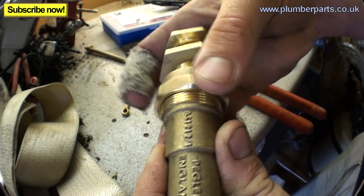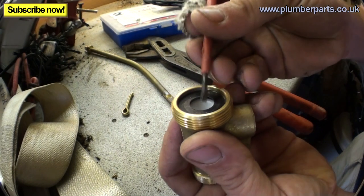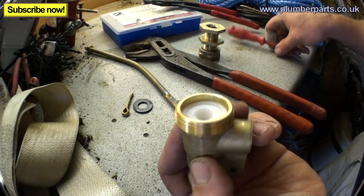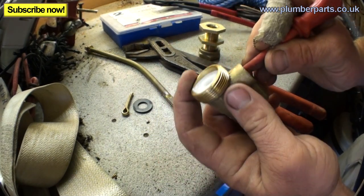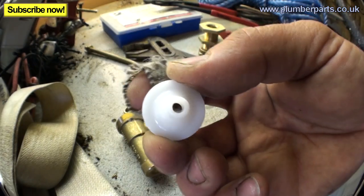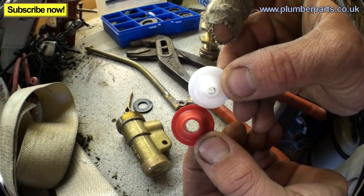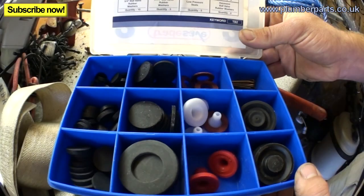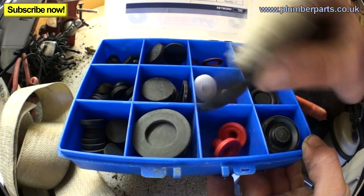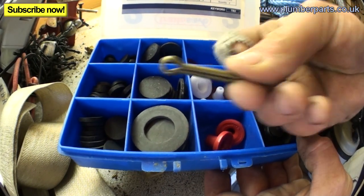Be careful when you remove this bit because there's a small washer that might fall out just here. Generally when you're doing any work on these, you'll pull that washer out and replace it. So now we're getting to the bits that sometimes leak. This is the jet - this actually regulates how much water comes out. Water comes out of this small jet just here, as you can see. You do have different types of jets, so if you want the water to fill up more, you can have a red jet which has got a large hole, or a white jet that's got a slightly smaller hole. A service kit like this is a great way to start when it comes to fixing these, because you've got different types of valve washers, replacement seals, replacement jets, and even replacement pins if you need them.